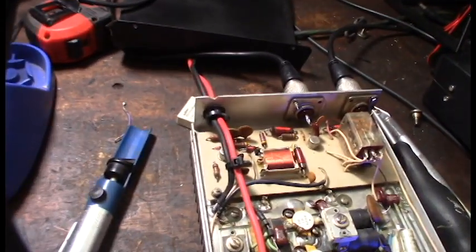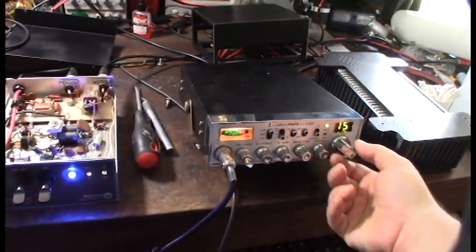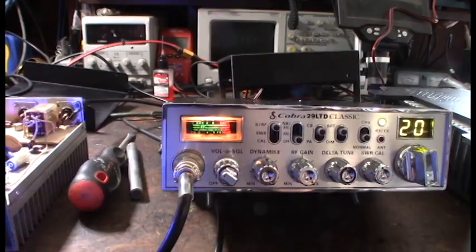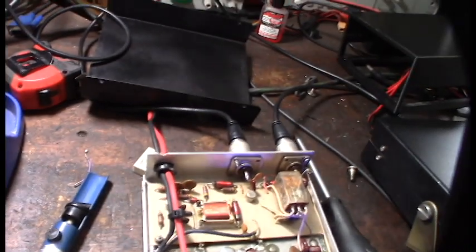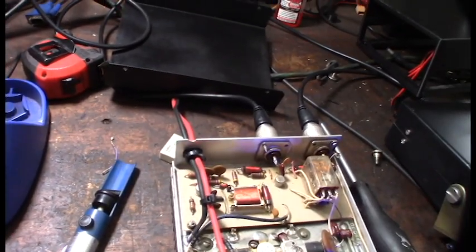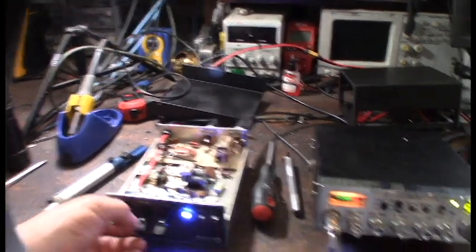Now that I let the stuff sit for a little bit, it's way more reliable. There's somebody talking on the channel — good conditions right now. It actually makes a big difference in what you can hear. If you're having the same issue with your amp's preamp — because these things always fail — try to get in there and check the contacts first. It went from not working, to intermittent, to now it's really consistent with the DeoxIT on there. I'll put a link in the description.